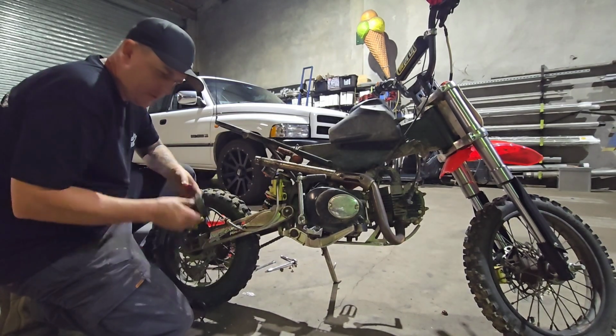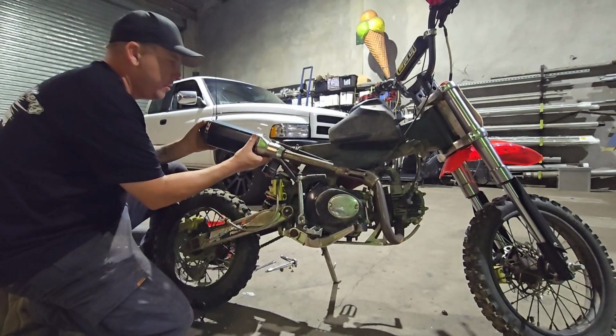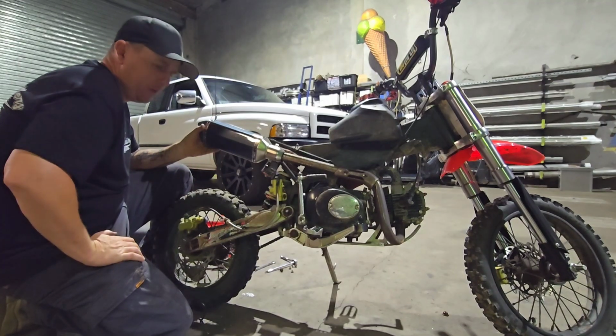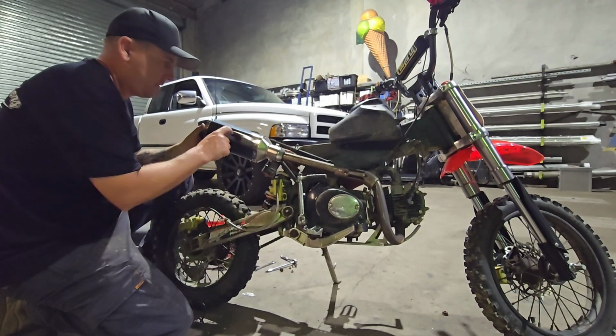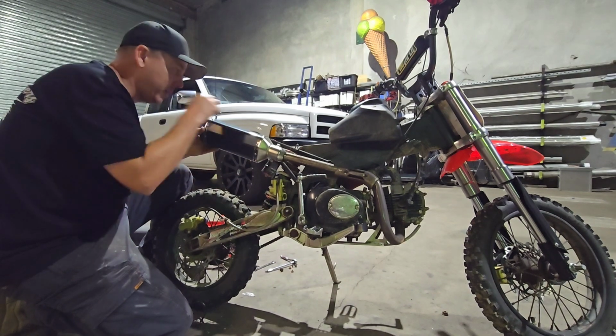Where I'm at is, this is going to be too long. We'll go on there. I need to mount it about there. It runs into the plastics here, and my mounting point is now halfway through the muffler, which would be fine if it was stainless steel. I'd make up a nice bracket or something like that, but it's not. It's carbon fibre, so that ain't going to work for me essentially, unless I can come up with some way of pop riveting to it.